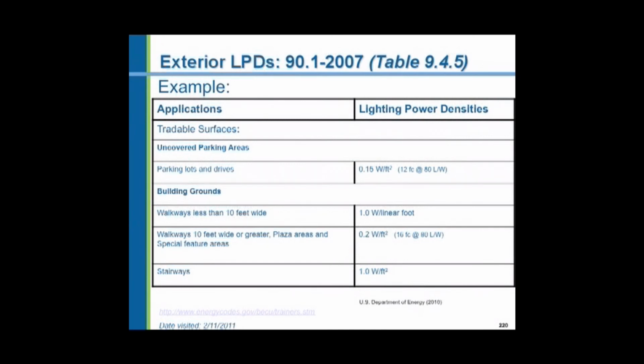And so it may be 20 foot candles directly under the fixture, and then out to half a foot candle, at which point you will install another fixture and pick up at half a foot candle, and the lighting level will go up to 20 foot candles directly under the fixture, and then down to half a foot candle. And so you would install these lights. Well, the average would be 12 foot candles.